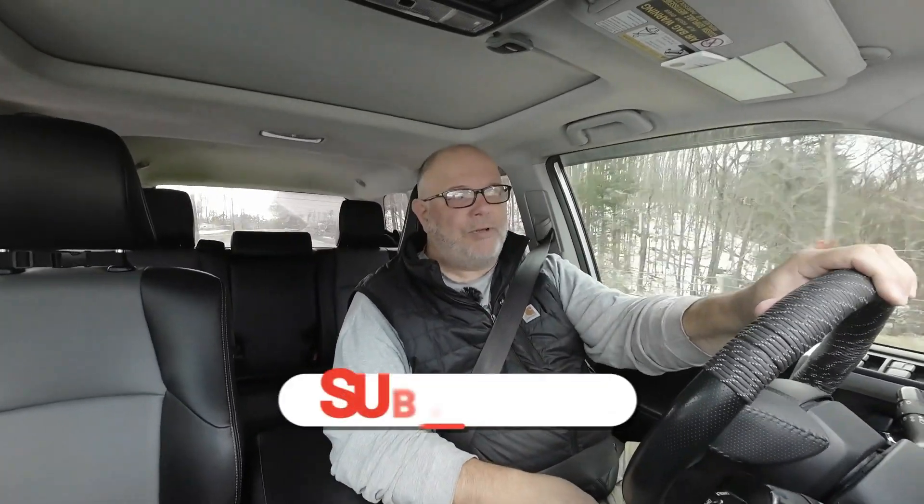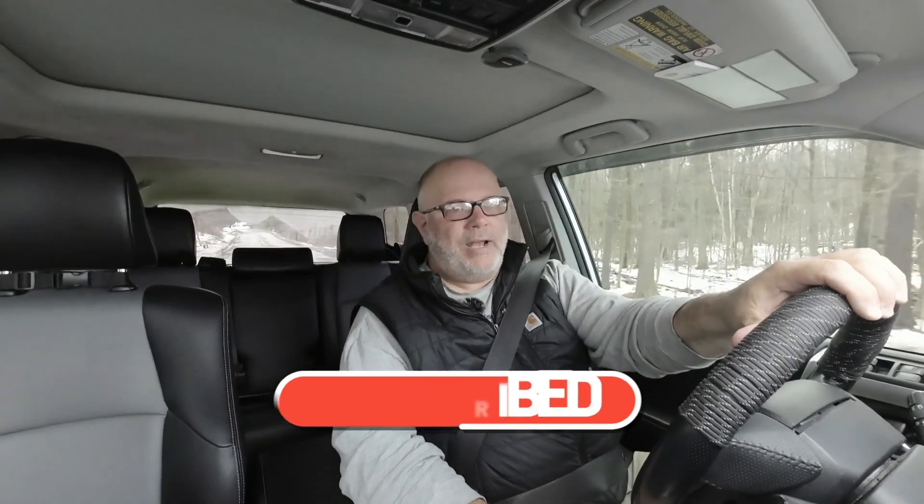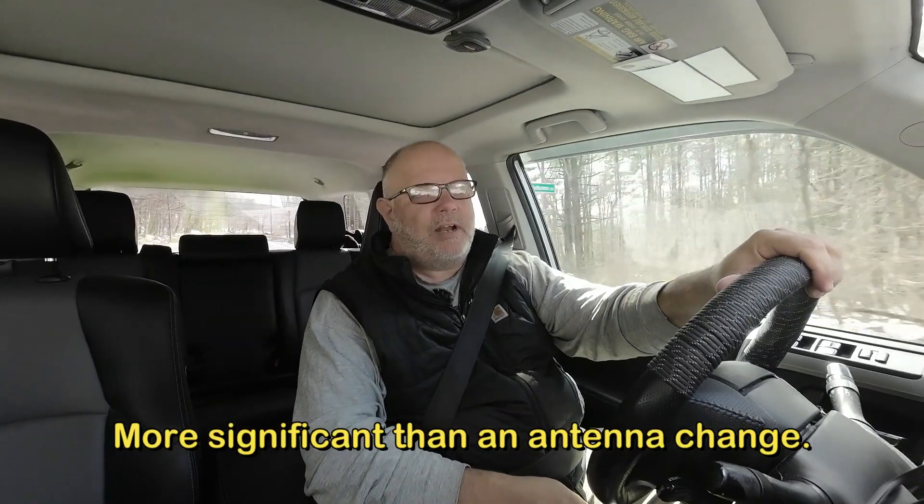This video proves that you've got to go out and test your equipment. I'm only using a 15-watt mobile radio, and Bob was only using a small portable radio, and we had pretty good performance. There are a lot of variables with a two-way radio — line of sight is the biggest one. The most important thing we learned today was on Bob's end: if you sit in the truck, your performance is going to suffer. As soon as he got out of the truck, there was a significant increase in performance — even with the windows and sunroof open, being inside still took a hit.